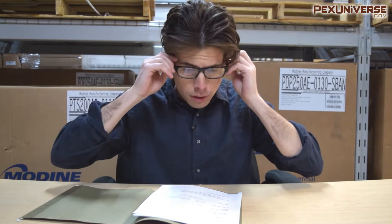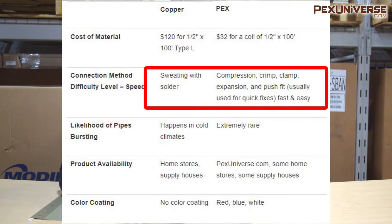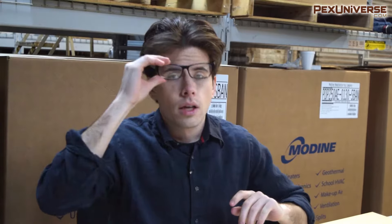The first and most common question is: why should I use PEX over copper? The biggest reason is cost efficiency — 100 feet of PEX costs a lot less than 100 feet of copper. Then there's the simplicity of connection: with copper you need a pro to solder it, which isn't DIY-friendly. With PEX you can use crimp, clamp, or expansion methods — there are a lot of options.